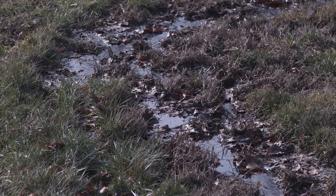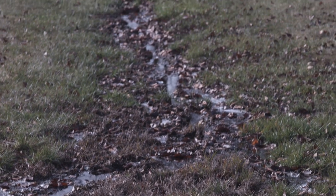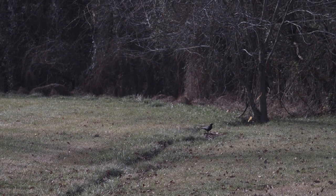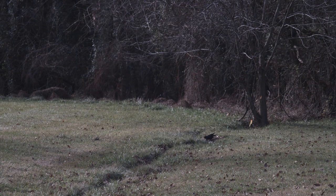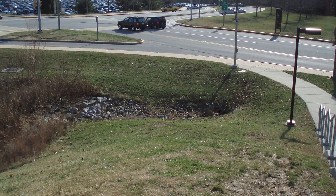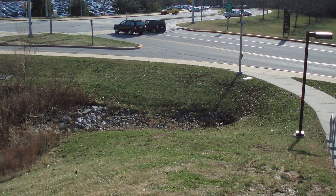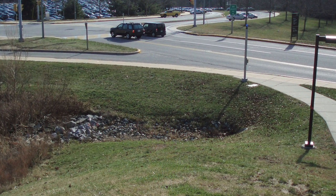It is evident that the channel is starting to erode just downstream of the outlet. What should be a smooth grass channel is forming a gully and could easily continue to erode and become a greater problem if nothing is done. Despite the gully's appeal to the local wildlife, it has the potential to be adding unwanted sediment to the stream. The field team also noticed that some runoff from the adjacent roadway bypasses the stormwater pond and flows directly to the outlet. This untreated roadway runoff is conveyed through the eroding channel directly into the stream, carrying with it any pollutants picked up from the roadway surface.